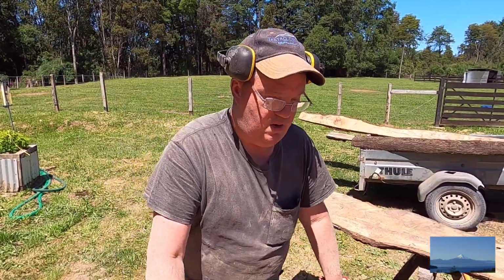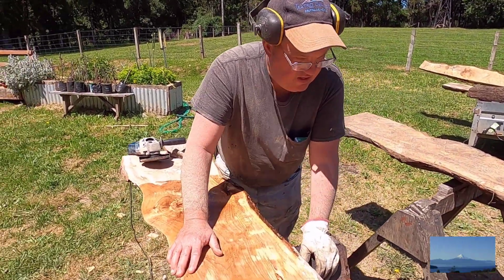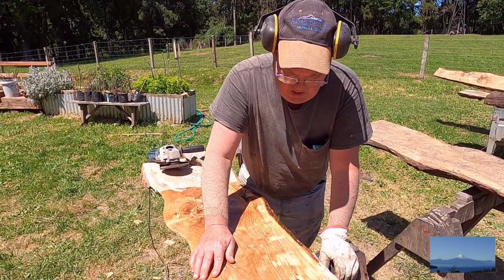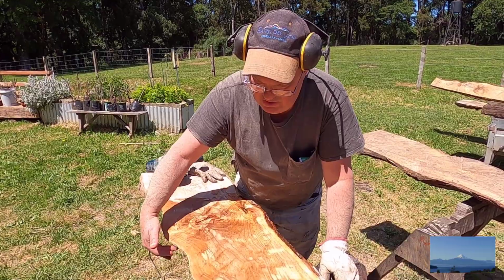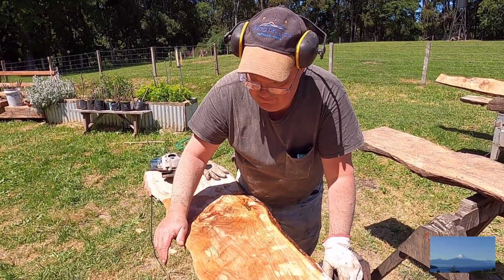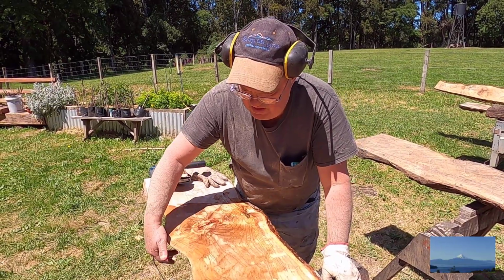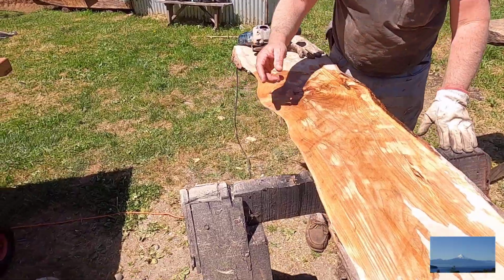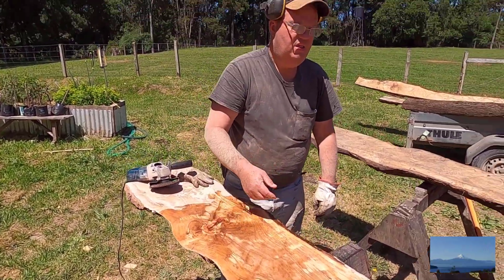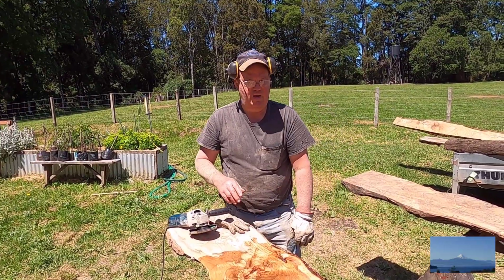And then I don't even know if I'm gonna sand it any more than just the edges, round over the edges, take the bark back off the edges a little bit. And I'm just gonna hit it with polyurethane. And then I'm gonna do a rabbet through the bottom of it, almost the same thickness as this leg, basically, as this sawhorse. And that's gonna be countersunk in. Then I'm gonna bolt it down either with machine bolts or lag bolts.